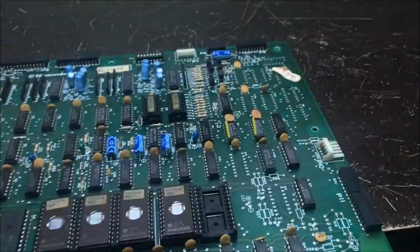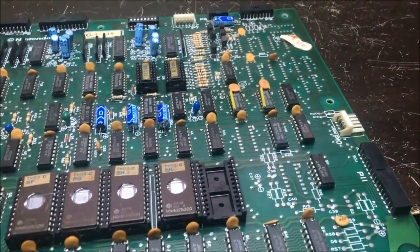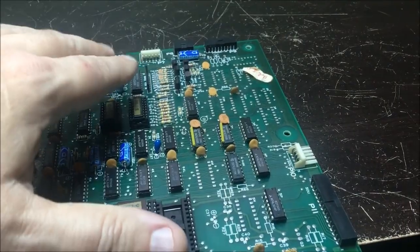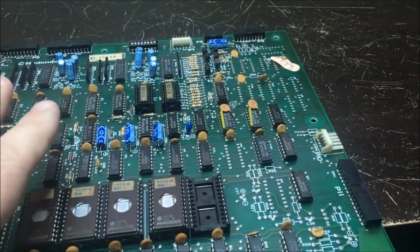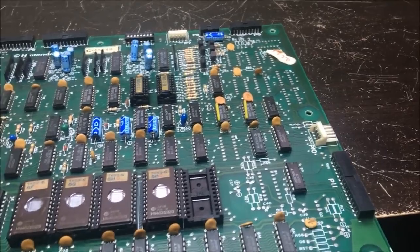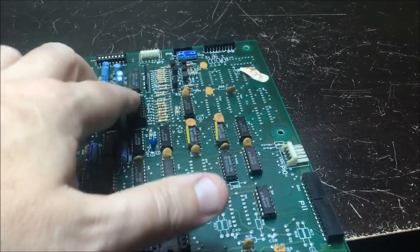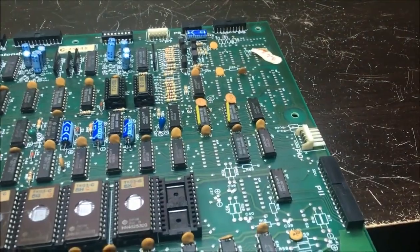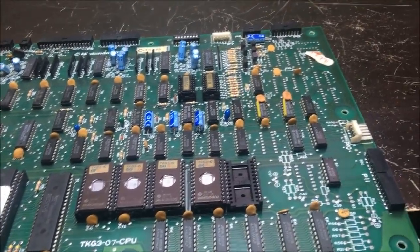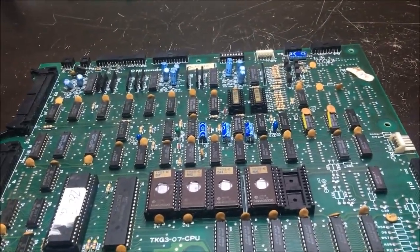So yeah, I'm gonna do that first thing and get this data flipped, so that I'm doing it digitally. I'm not gonna add a bunch of junk up here because I don't want it to be permanent. Because whoever ends up with this board set might have a Nintendo Donkey Kong cabinet with a Sanyo monitor in it. So what I'm gonna do is do this repair, and then put it back to normal. I'm going to jump that, and then put the regular PROMs back in it so that it is ready for going in a Nintendo cabinet. So, yeah, that's what I'm going to have here. 4-stack Donkey Kong board set.